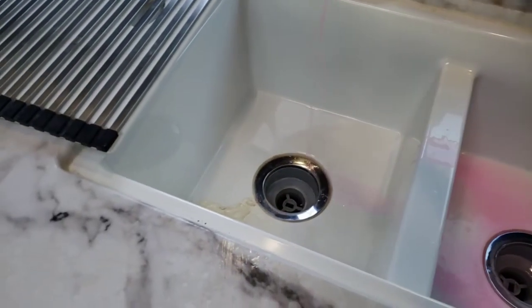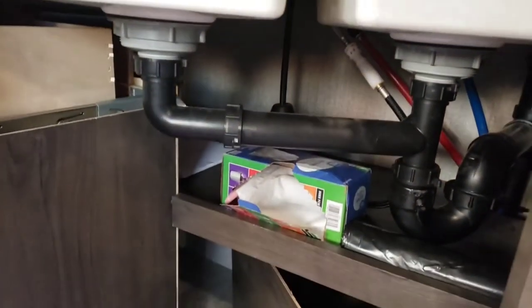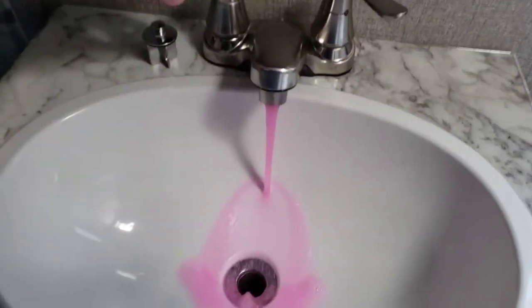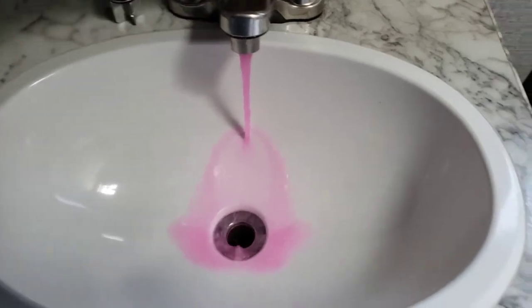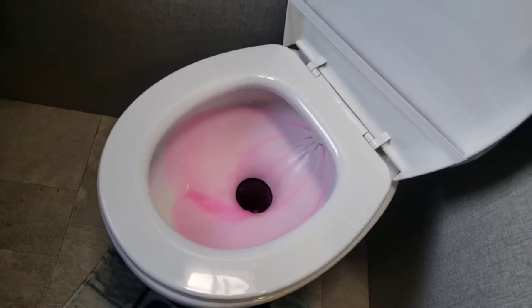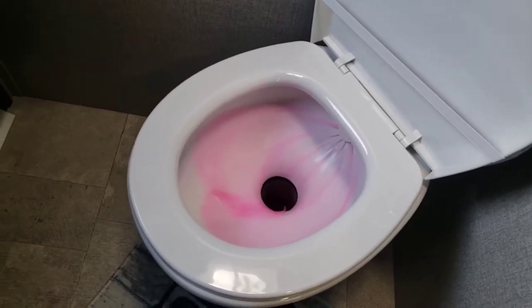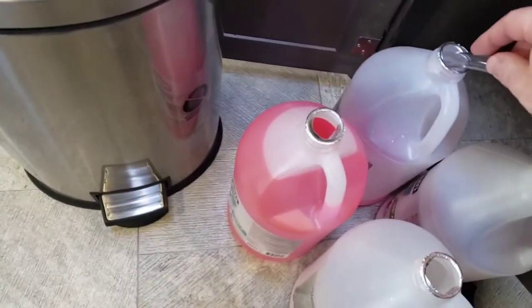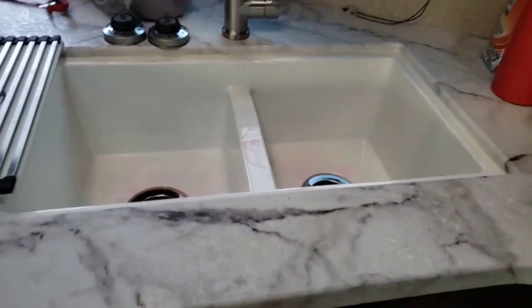This one's now drained. I'm going into the third gallon because I put one whole gallon on the ground outside by mistake. In your sink, I like to make sure I flip-flop the handle so I'm filling both hot and cold sides. I've got that low drain there, but the P-traps are what really matter — I just want to make sure I'm coating everything. Once I got it coming through nice and clear, I'll go ahead and close that. I'll run the toilet a little more and put some antifreeze in there to fill that toilet bowl a bit with the pink. I've now cleared out my fourth gallon, and I think three gallons was good — I had solid pink on everything.